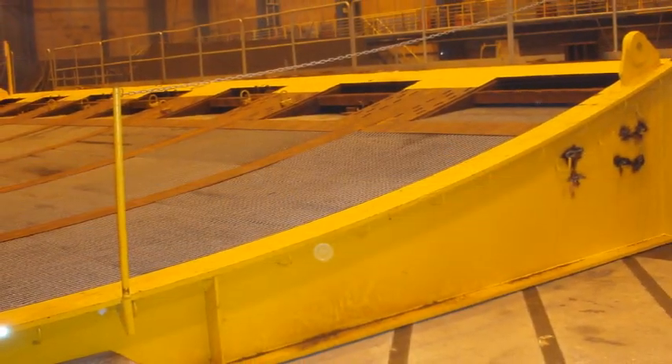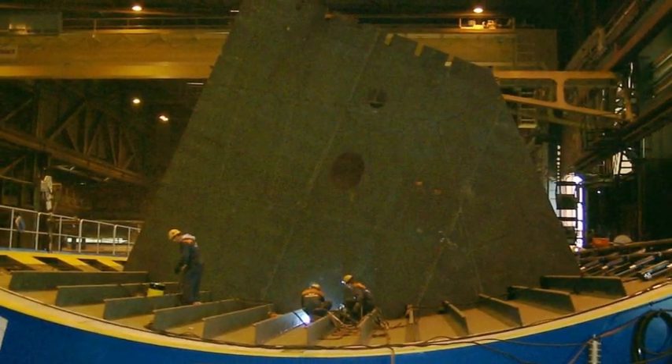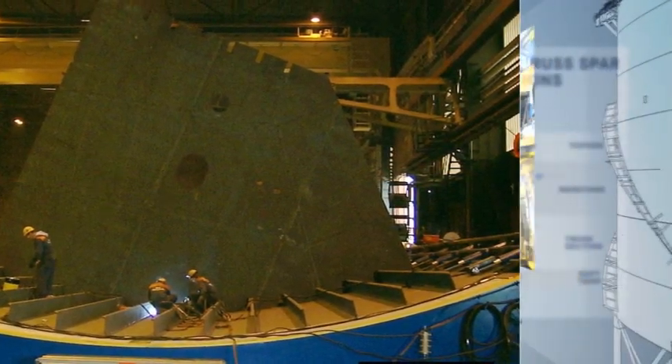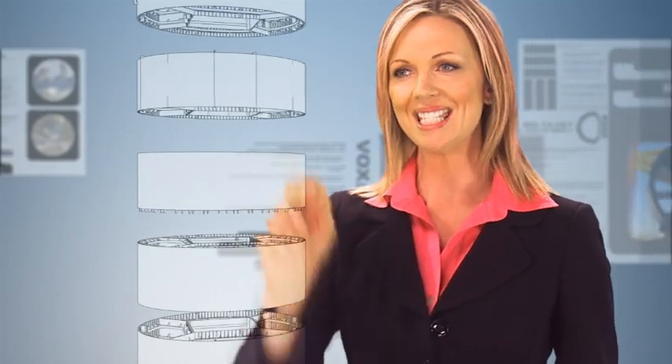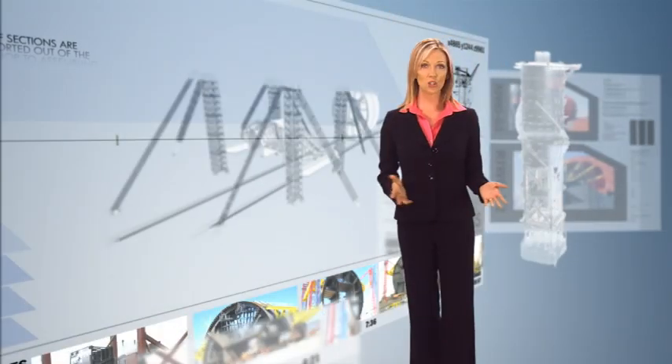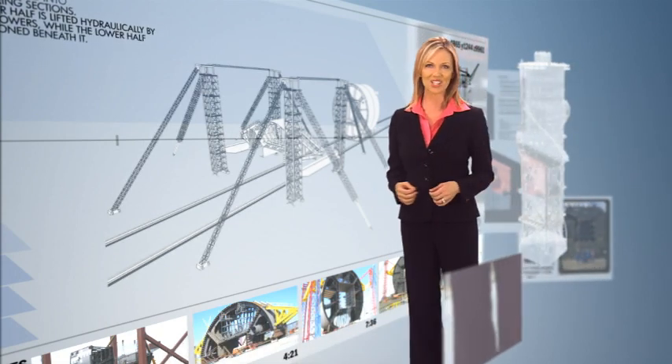After the panel line phase, shell panels are sent to the bending jig, where they are bent to the design curvature of the spar and then fitted with ring girders and deck sections. Depending on its overall size, the hard tank includes between five and nine ring sections. Inside the workshop, each ring is first assembled in sixteenth, twelfth, eighth, or quarter sections, which are then combined into upper and lower half sections. The half sections are transported out of the workshop to assembling rails in the yard, where they are mated into whole ring sections.